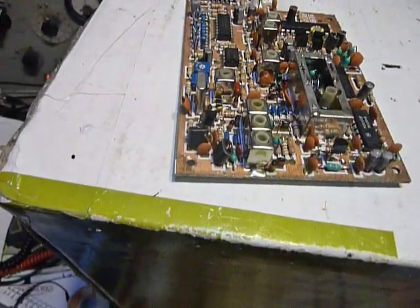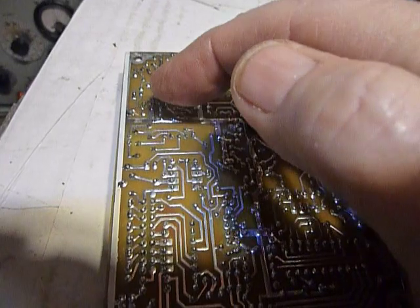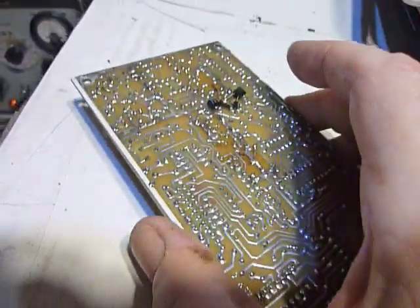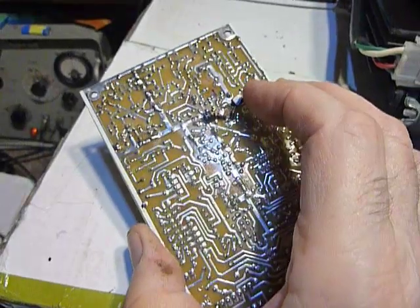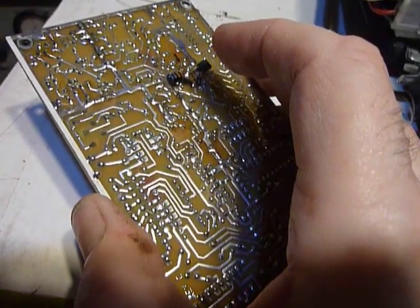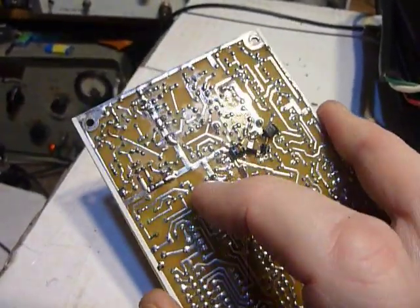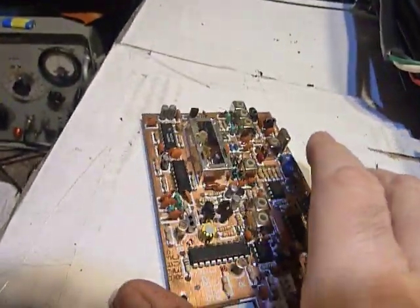Anyhow, after doing that and squeezing on these a few times, the thing is working, but it does cut out after a while. So I'm going to re-solder this area with my little tiny soldering iron and some very small 60-40 flux solder — 60-40 solder with a rosin flux in it. Just the other day I grabbed a roll of 40-60 solder by mistake, which has an almost 100-degree-higher melting temperature, and things were not going well at all. You want 60-40 solder for electronics work because it melts at a lower temperature, so there's less chance of doing damage to the board.